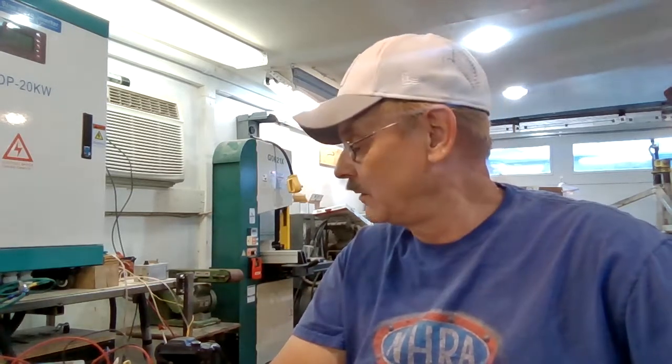We're charging a Better Place battery pack at four kilowatt hours. I've got a five kilowatt hour array, but I do not have a maximum power point tracking system in it, so it's just wild charging — whatever efficiency point the conditions happen to be at for the solar panels, that's the amount of power it'll give you. Certainly not optimized.